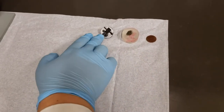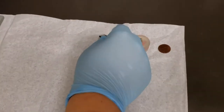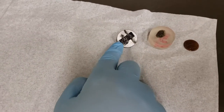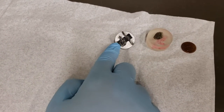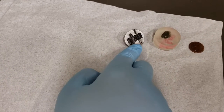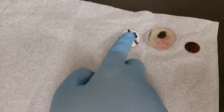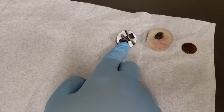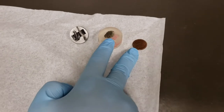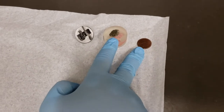For powders or fibers, we're going to grab a stage and use a little bit of double-sided adhesive tape that is also electrically conductive to stick it to our stand — just like these have already been stuck to the stand with that black carbon tape. This is a double-sided tape. We'll stick it to the stand and make sure there's an electrical connection.